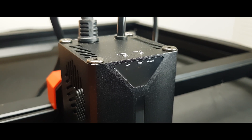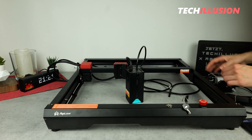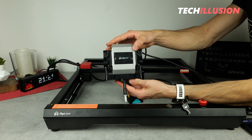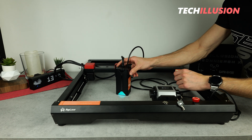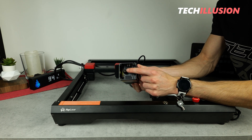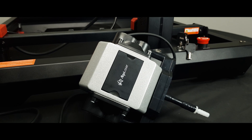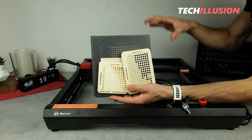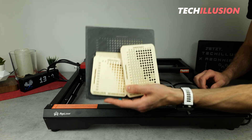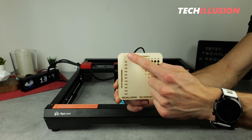Furthermore, on the top of the laser there are two cables. One of them is for the air supply from the air pump. The air pump ensures that fresh air is regularly directed to the laser module. The air comes out right at the laser spot, and it helps to exhaust all the smoke generated when engraving and cutting wood directly. Because of this, it's only possible to truly harness the maximum power of this laser. I started with dozens of test engravings until I found the perfect final results for this laser.